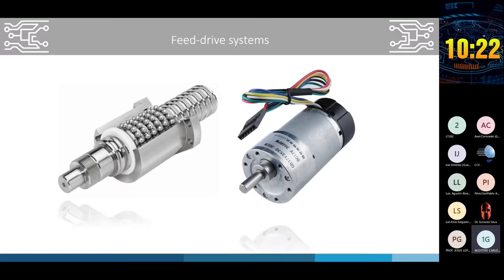We have to optimize energy consumption so the motor will consume only as much as necessary by PWM. The final control element is a ball screw, which allows us to convert rotational motion into linear motion. The ball screw consists of two parts: the screw and the nut. This element offers lower friction, which must be lubricated. For micropositioning systems with high precision, ball screws are especially manufactured so that the screw pitch is smaller. The feed drive with ball screw is the most used driving mechanism for long-stroke trajectory positioning at high speeds. The challenge of studying this type of system arises when adequate resolution and accuracy must be obtained.